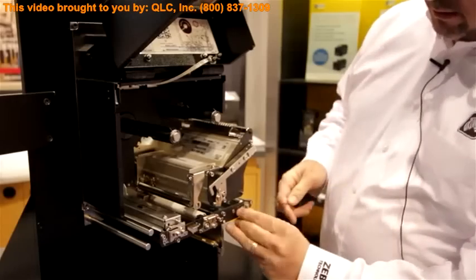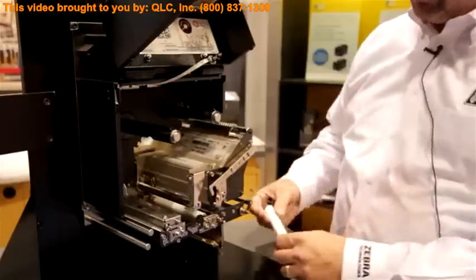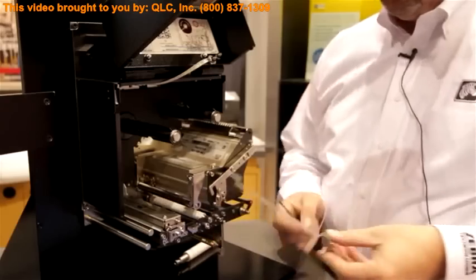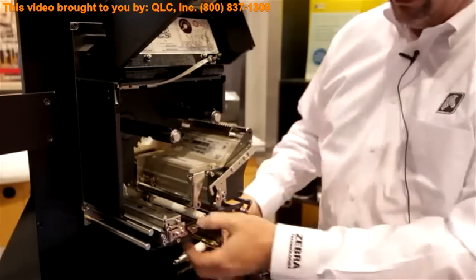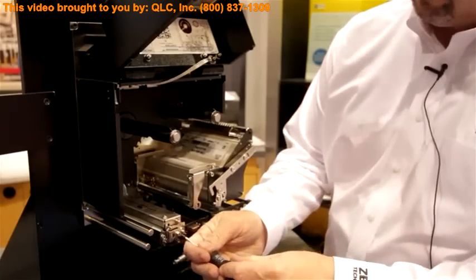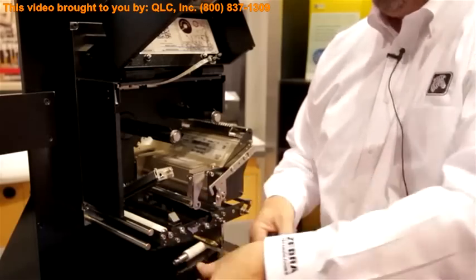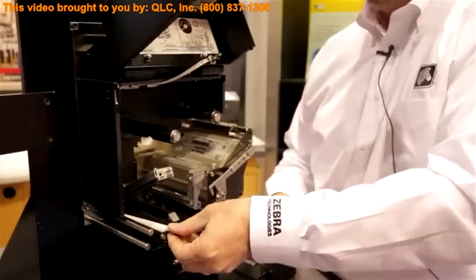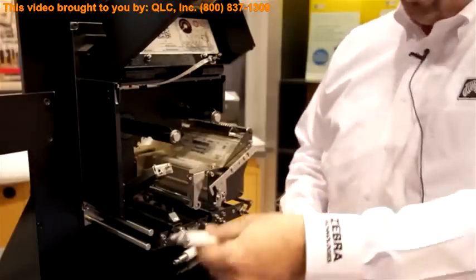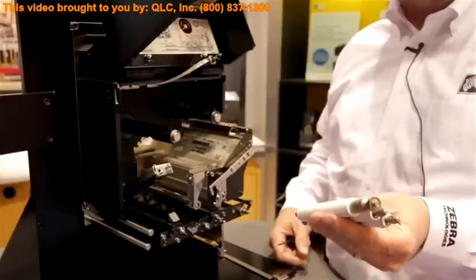To remove the platen roller, rotate and pull it out — platen roller changed. Just heavy-duty pins that lock into a coupling system on the inside. The peel and pinch rollers remove in a very similar fashion with captured fasteners that don't fall on the floor when you take them out. The pinch and peel roller are now the same exact part number, no more putting those back in the wrong places. Three rollers exchanged in just a matter of minutes — used to take hours on the previous model.